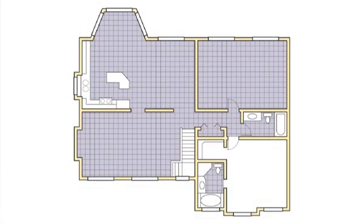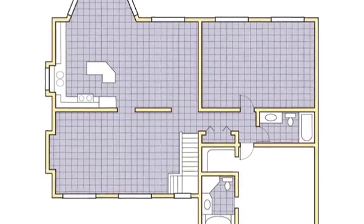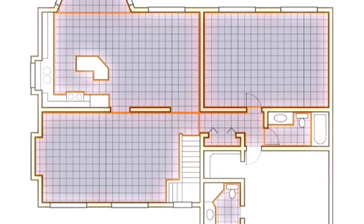Oh, I like no maintenance! Where do you put movement profiles? Well, you're going to need them at thresholds with continuous tile floors — that's from one room to another if it just keeps going. Outer edges of tile installation areas like the perimeter joints, and also against any restraining surfaces such as cabinets, walls, columns, etc.